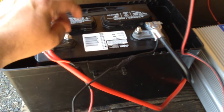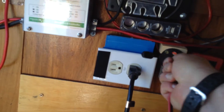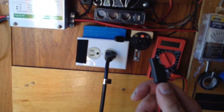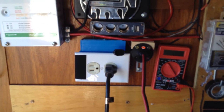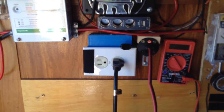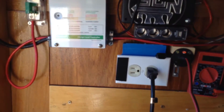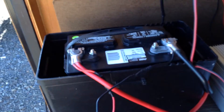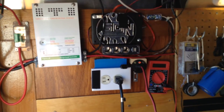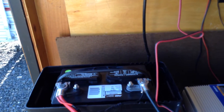We've got the little side adapter, and that's to avoid having a stack of things that pinch down on this. Tying it into my main electrical system using this connector allows me to have these batteries kind of equalized with each other. But you don't want to leave it like that full time with a load on there because it will draw down the whole system. Because this system is so overpowered — I have 400 watts of continuous power production whenever the sun's out and only about 5 watts of power usage when the sun's not out — I can afford to leave this in and it helps equalize the charge between batteries of different sizes. If you're really going to use something like that continuously though, you need your batteries all hooked up with each other using a thicker cable.